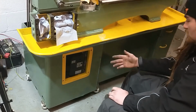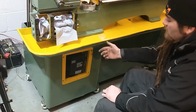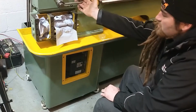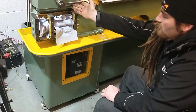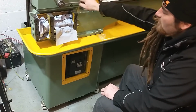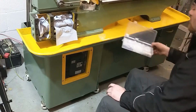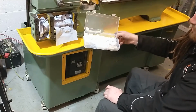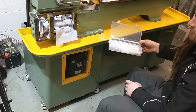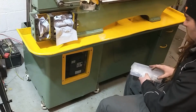And then, as I showed in the previous video, I've got the communication side of the inverter linked up to the original control levers for forwards and reverse, on and off. They will be connected using a quick release connection, so if I ever need to remove the inverter, I can just pop the connection off and change it out in the future if necessary.